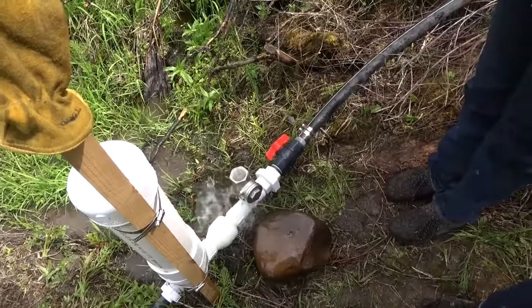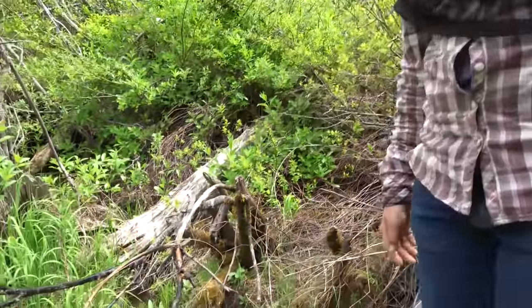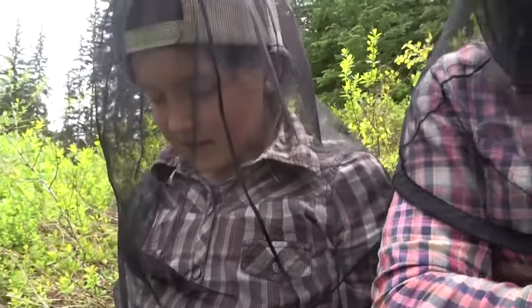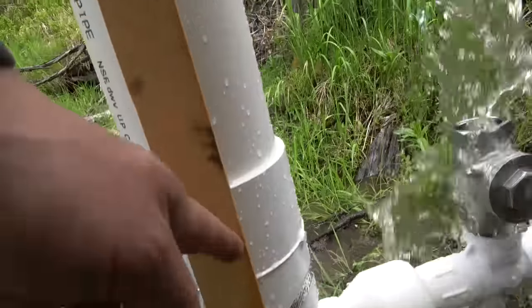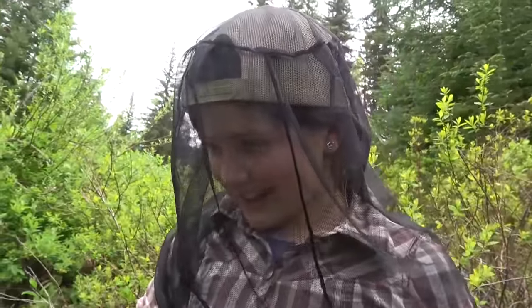It's a water hammer — that's why they call it a ram pump. When the water flows, it gets some momentum, and then at a certain flow it makes that gate shut. When the gate shuts, it stops all that flow, but the water coming down the pipe keeps ramming the end, goes through the check valve, and gets a pressure surge into this tank and up the line. The high pressure can go all the way up to our water tank. It's working!